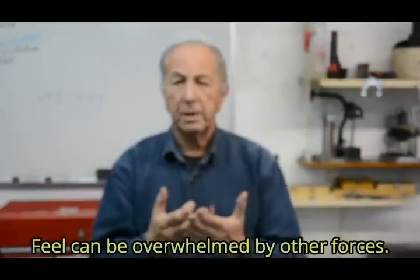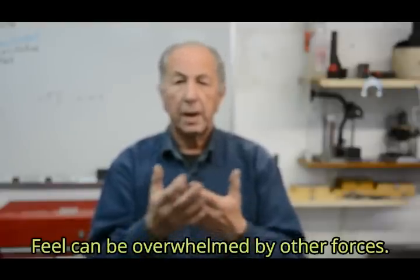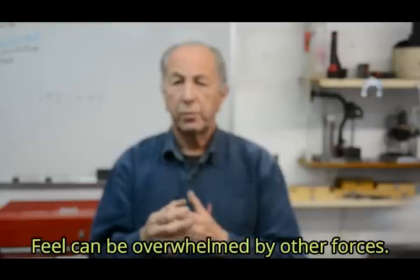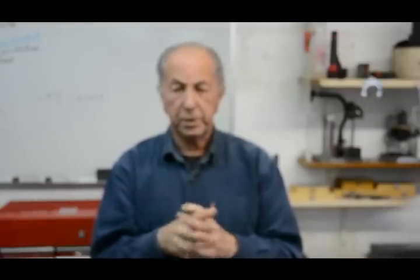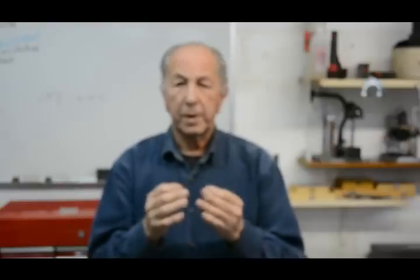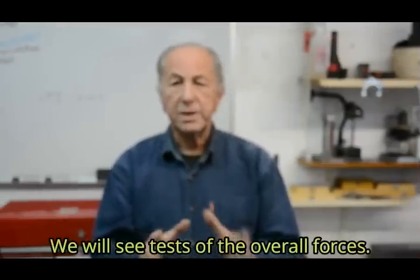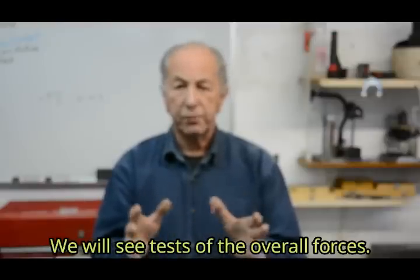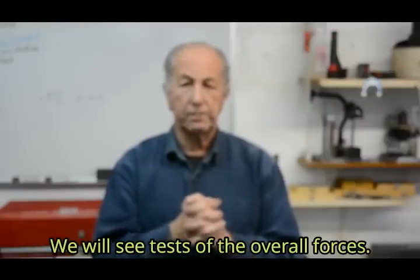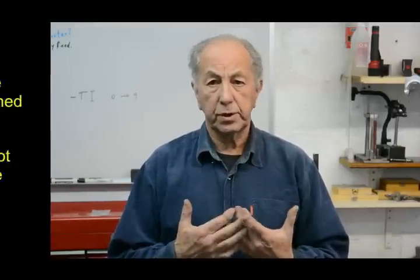So the idea behind a sensitive drill press is that you eliminate as much as possible any forces other than a direct multiple through the leverage ratio of the force on the drill bit itself, which gives us the greatest chance of being able to feel what's happening at the drill bit and reducing our chances of breaking it. In this video, I show some tests that I did on actually measuring these extraneous forces and seeing what we can do to reduce them. I'll show how using a counterweight is often preferable to using a spring.